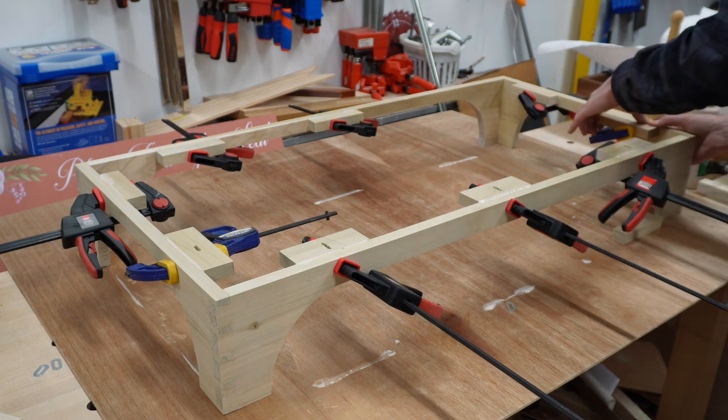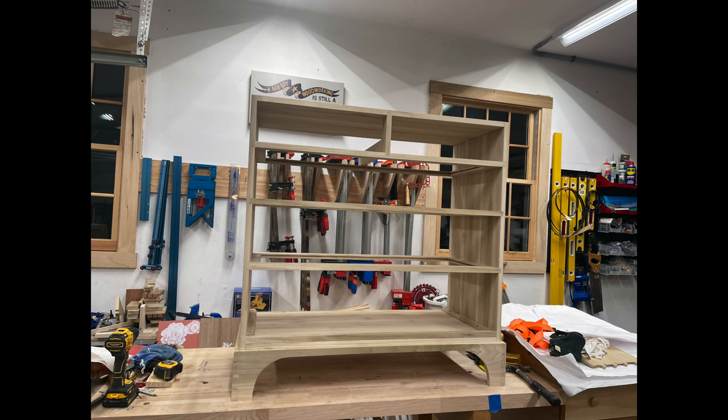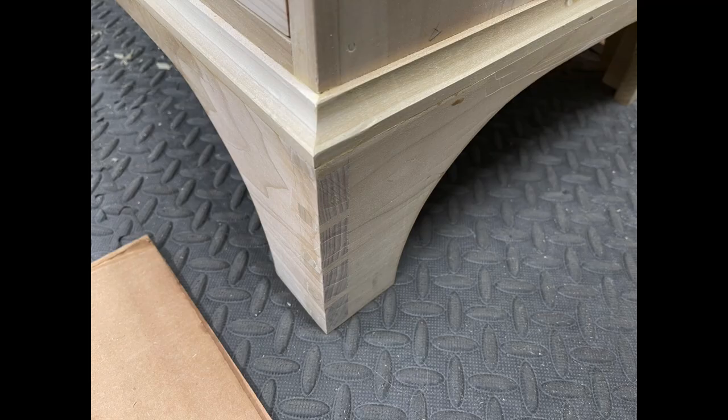Here I fastened all the glue blocks to the inside of the base. I've attached the carcass to the base, and the interior is pretty much done as far as the major components — it's really starting to take shape now. Here's a close-up of the through dovetails on the base; I was happy the way these turned out, they look nice and crisp. Above that you can see the molding that surrounds the chest on three sides, cut on a router table. Around wood movement, the molding is glued to the carcass and the base in the front, but on the sides it's only glued to the carcass and base for about six inches towards the front — beyond that it's only glued to the base to allow wood movement towards the rear of the chest.